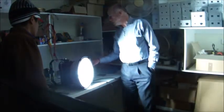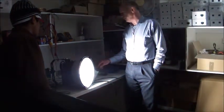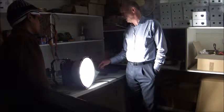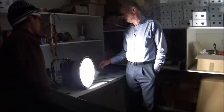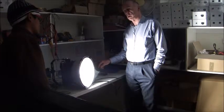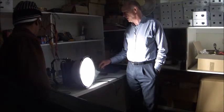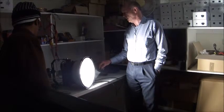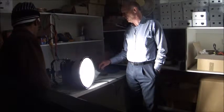Let's bring it down again to confirm. Running down: 146, 129, 115, 100, 93, 90, 86, 85. Drops out again at 85 volts, confirming the LED dropout voltage.